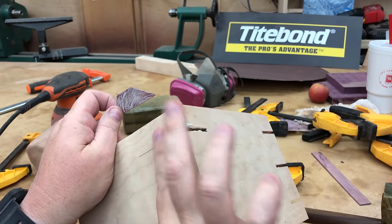Once those are done, the band saw leaves the cuts a little bit rough, so we'll take this over to the disc sander — Maya is doing this here — and she's just going to smooth it up and get rid of all those rough cuts. That leaves a pretty good finish — of course it's not quite smooth enough and the sander did leave some scratch marks, but it only took about a minute to do. We'll take those scratch marks out with the random orbit sander. You get a good close-up look at the bottom here with the rounded radius corners, which I kind of like. Some people would prefer square corners, but that's a choice you can make when you build the box — do it however you like.